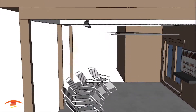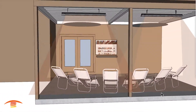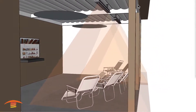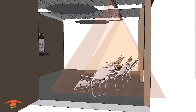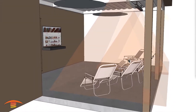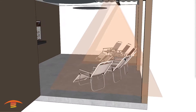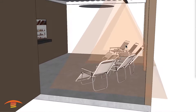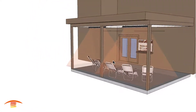Let's go ahead and look at the footprint of heat. With these two 4,000 watt units, we are getting just about perfect coverage throughout the space for the seating area. I think this would be the most ideal application here. If you placed the heaters over on the other side, the heat would be coming from your back most of the time — you're not going to get it on the front edge of your chest or face. These are light waves; as the light travels through space it will absorb into any object — chairs, tables, floors, or the human body. If it's coming from your backside it won't give you the best uniform comfort, so that's why I'm choosing this location.